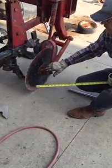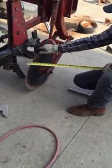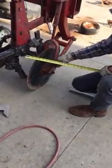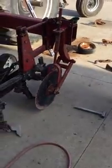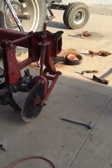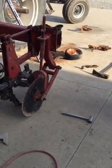This should get shiny if you cultivate very many acres. We want to take all the slop out of this and put new bearings in here, or get one where the bearings are tighter. Okay, and make sure all your gauge wheels spin and don't make noise, and have a couple extras put together ready to go if a bearing goes out.